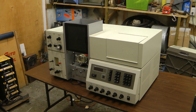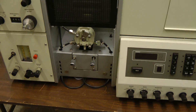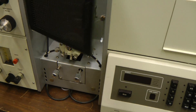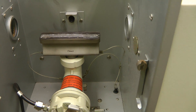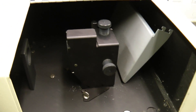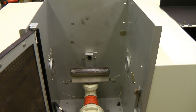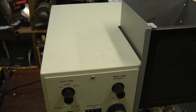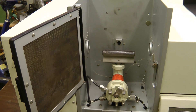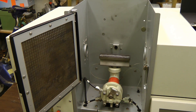Another odd bit of kit for teardown today. This is an atomic absorption spectrometer. Basically what this does is you take a sample of material in a liquid form, mix it with fuel and air and burn it, then pass a light from a lamp over here — which is missing unfortunately — through the sample. Molecules in the sample absorb some wavelengths of light, and then it goes into a detector of some sort. This is used for analyzing the chemical makeup of the sample. Certain different molecules absorb different spectral lines.